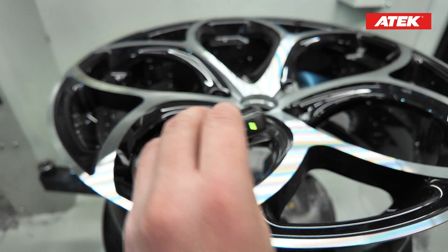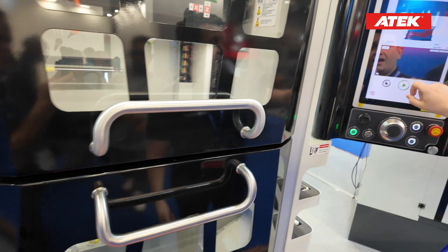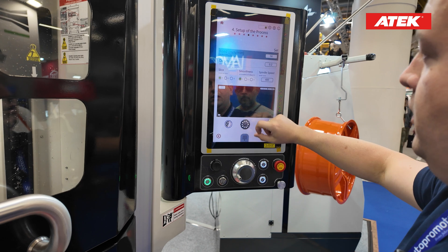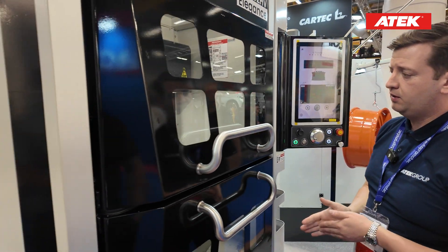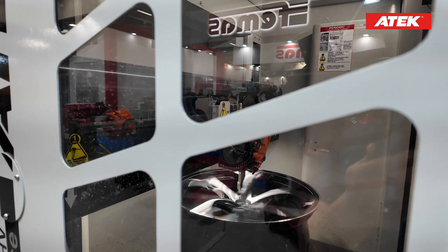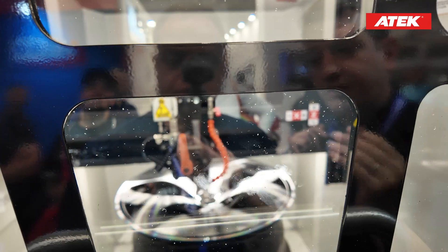The wheel has lots of thread. Now I will show you how to make the mirror effect. Let me close the door, go deeper, and change the feed rate to 15. You can also increase the spindle speed if you'd like. For this wheel, 50 to 400 spindle RPM works well for me. You can see the difference between the right side — the newly cut area — and the left side of the wheel.